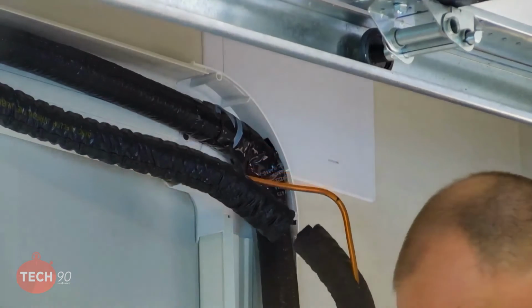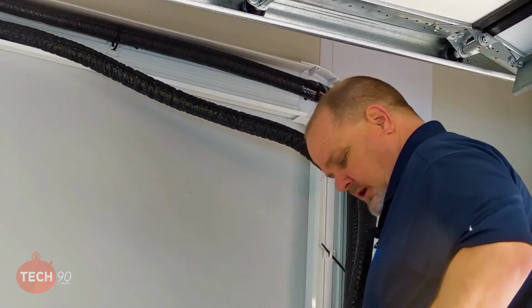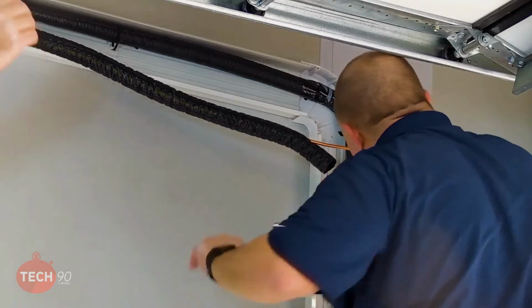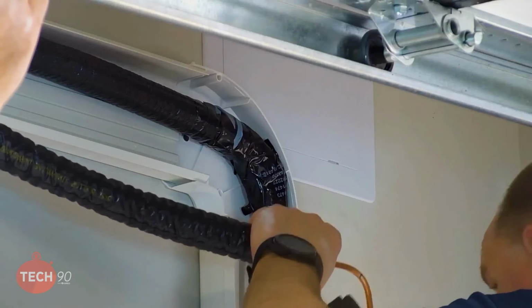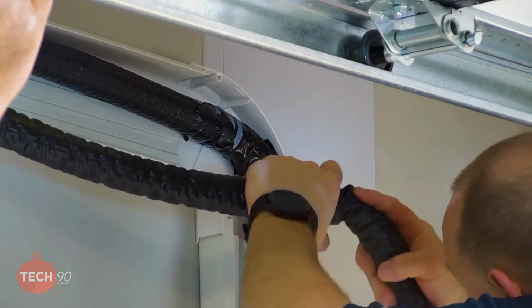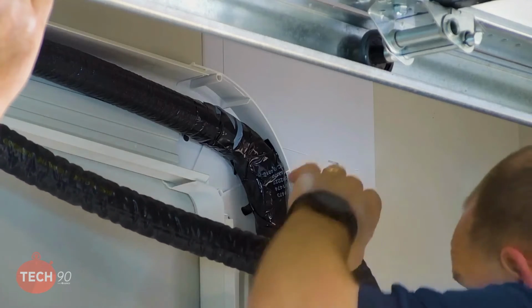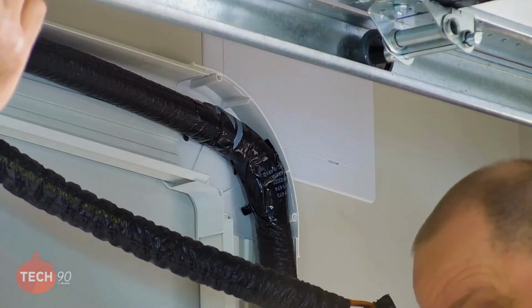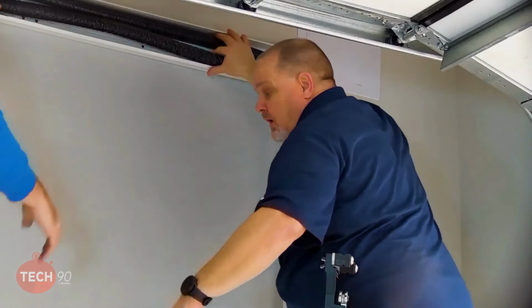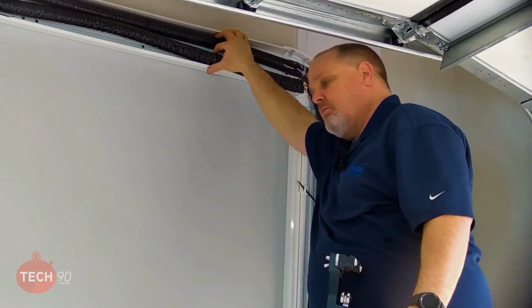So I know a lot of you guys out there be like, man, that's 1/4 inch. You can bend that by hand. Again, I want to go back to what I said earlier. These machines do not tolerate ovaled out pipes. They don't tolerate kinked pipes. So I'm going to tell you the best thing for you to do is always use a bender on every single bend.